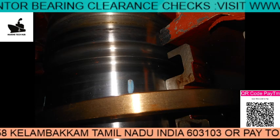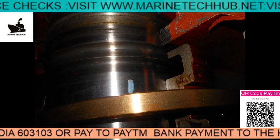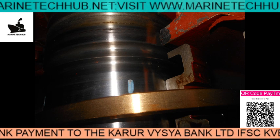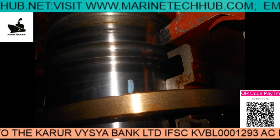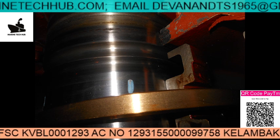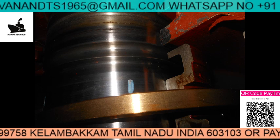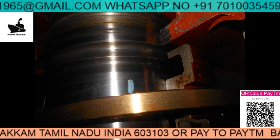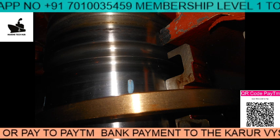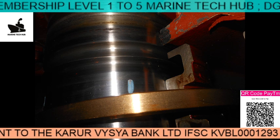You can see here — once you keep the plastic gauge and press, put the cover back, and you can see a mark here. It has been pressed. Previously they were using lead — lead was kept and pressed, then the thickness of the lead was measured. Now we are using plastic gauge; it makes an impression, and this is one of the important things you should understand. If you have any questions regarding the clearance, you can message me on WhatsApp or email. If you make payment to my bank account, I will give you one month full support on board the ship and full video links.